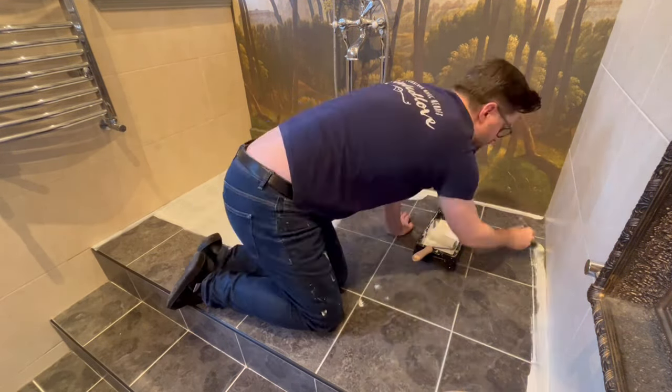As you can see, I'm working from my towel, and I've also got a little bit of shop rag to one side, which is where I'm offloading some of the paint from the brush to prevent getting bleed through. If you apply a lot of paint on your stipple motion, you're likely to push paint underneath the stencil and you won't get as clean a look to your finish. So that's about it for stenciling. I'm hoping you're loving the design. Here's a finished view of how it looks at this stage.